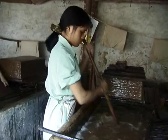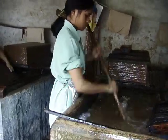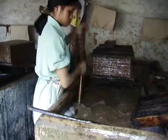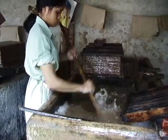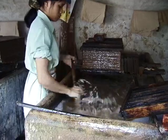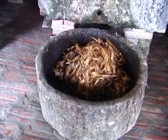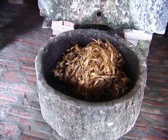There were seven young women working at the vats. The girl at the back is vigorously stirring the pulp to keep it in suspension. She does this routinely after adding either more pulp or more formation aid. In front of each vat is a container of formation aid, the stuff that we have seen in the basket